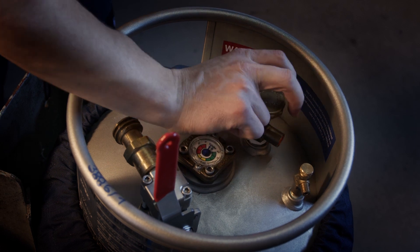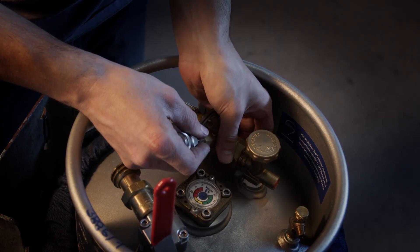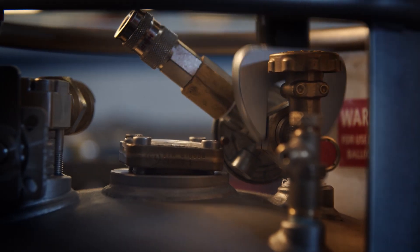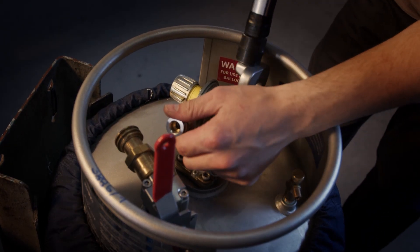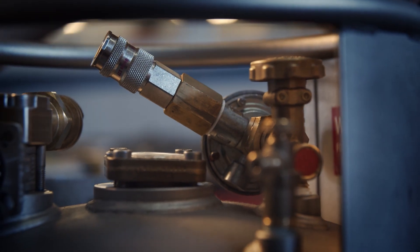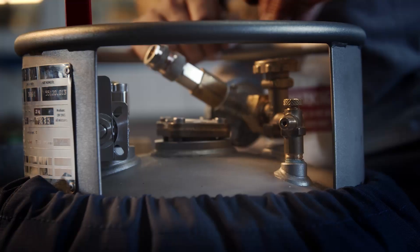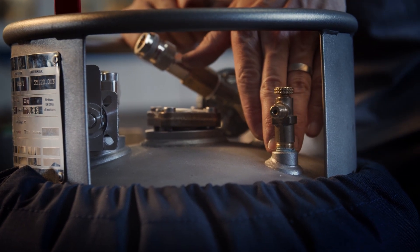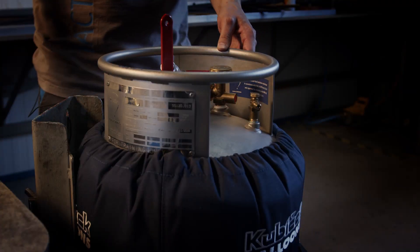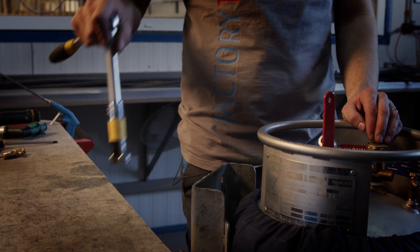Now I put back the filter, then the jet with a Teflon ring, and start to tighten. Now I finish the tightening. Make sure that this end isn't higher than this ring. You can have problems with leaking between the thread, or the next problem can be closing the valve. In this case you have to put new Teflon tape or replace the whole Maxfill valve.